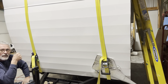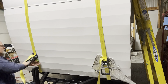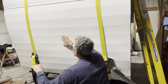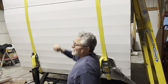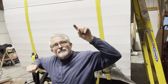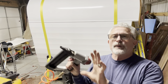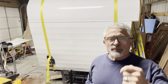I'll recheck that, and if I have to, I'll pull those staples out and go up a quarter of an inch — but I need to check that on both sides. Just one more click, same on the other side. You can see where that's bulging out, so I'm going to have to go up about a quarter inch. I'll pull the staples on that seam, move it back a quarter inch after I mark it with a pencil, and we should be pretty perfect. I took a quarter inch up — I need to be able to press this thing in as I staple it. I'm not going to put a whole bunch in, but enough to keep it there until we put the J-rail on.